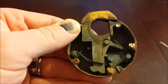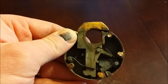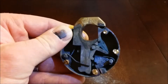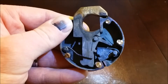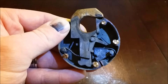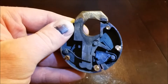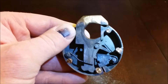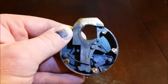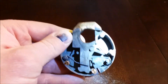It's totally disabled. And I'm not sure if all those springs got bent from a botched picking job or what. But you can see down in there, there's two problems. Number one, some of those springs were above the bolt, and number two, some of them were bent, like just smashed completely down. And I'm thinking someone stuck something up in here and just tried to force this thing open, or maybe tried to get a key made or something. I'm not sure — it wasn't me, honest to goodness. I bought it like this. This thing looks pretty worn, so it could be old age too.